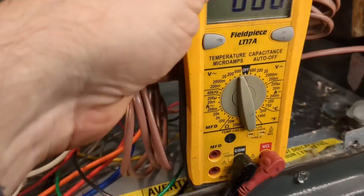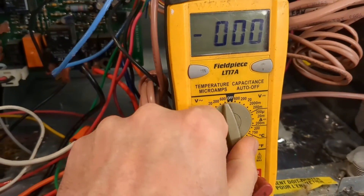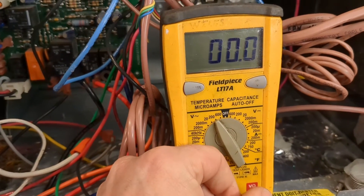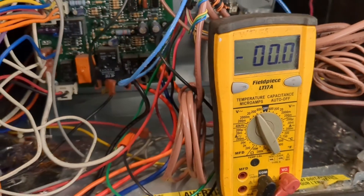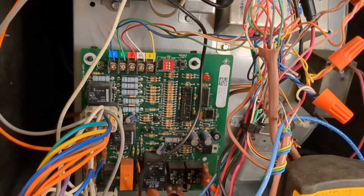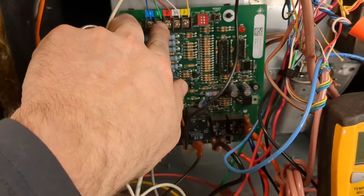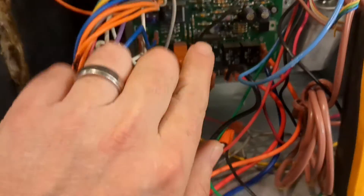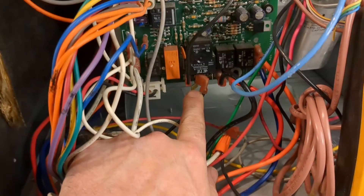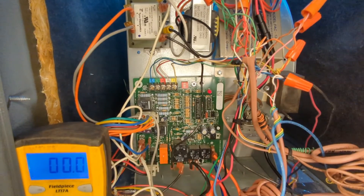In order to test for this, we are going to need a meter. We'll be using one of my old multimeters — a very basic multimeter. For this test, we will set it to 200 volts AC, because AC current is what we have on these furnaces. Up here at the top is the low voltage 24 volt terminal, and at the bottom is 120 hot. We're going to test between those two terminals. If we read around 150 volts, we have reverse polarity. If we read in the mid-90s, we have correct polarity.